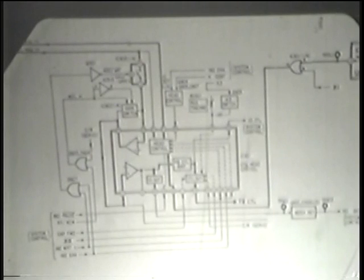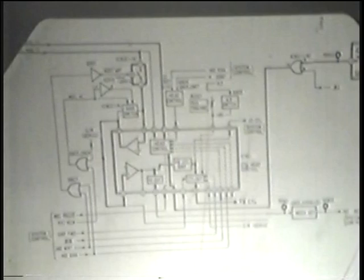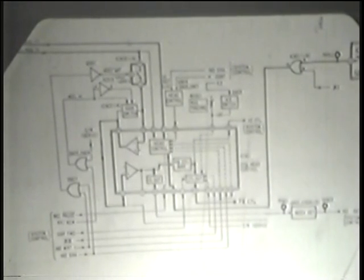Okay, now how do you remove the index mark then? All the machines that have it have an erase function. Does one work the same as the 27 on that? I haven't done it on this machine, I think. Pretty simple. It's not the same as the 27 either. No. You use the same key for mark and erase, as opposed to two separate keys. You hit your index key, you get the number of the index you want to erase, then you hit your erase key, and then you fast forward or rewind, and it'll go to that particular index and select it and erase it. But you have to hit the fast forward or rewind yourself? Yeah. Because the other machines would do it automatically. You can erase all the indexes by hitting the index once, and it flashes index scan, then hit mark and erase, and fast forward and rewind, and it'll erase them from that point on, and that point back, all of them.